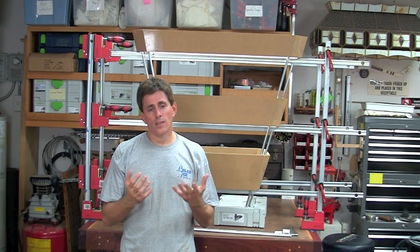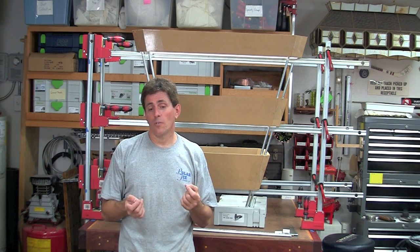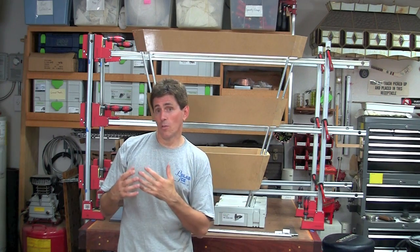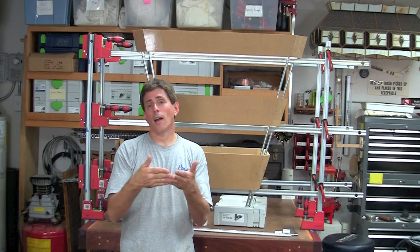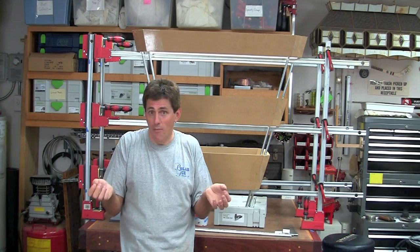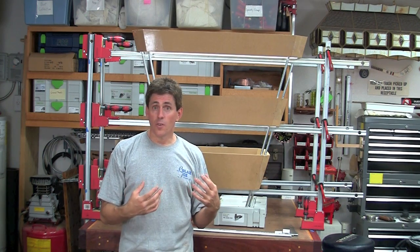And then I just didn't like it, I'm not really sure for what reasons, but then I started to think, what if we were to heavily chamfer the corners? Well, that's what these facets eventually grew into. Even if you're using four-quarter stock and you join it up at 90 degrees, how much are you going to be able to chamfer away? You're going to end up having at most a half inch revealed. So the facets add a great deal for me, visually, for this project.